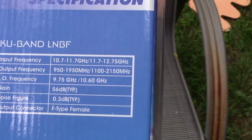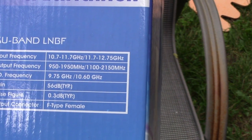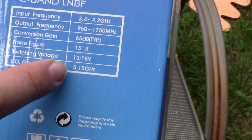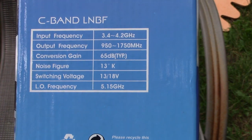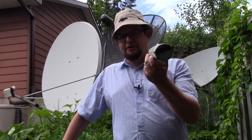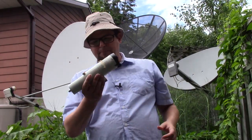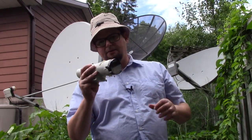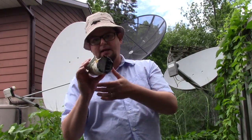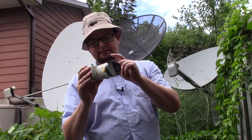The C-band is pretty much the same as most normal C-band LNBs. I just put in 5150 as I have in most C-band inputs. So with this one, it's a little bit more tricky. And the tricky thing — and people will say this about CKU band LNBs — is it took me quite a while, quite a lot of tweaking of this, to be able to get the C-band.